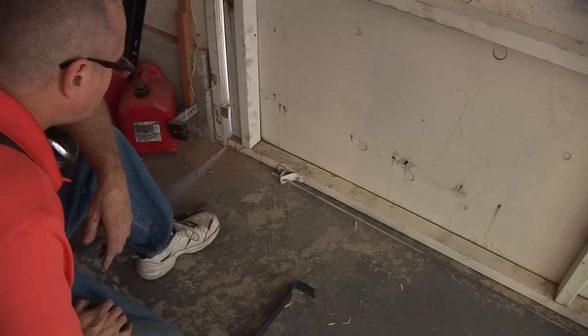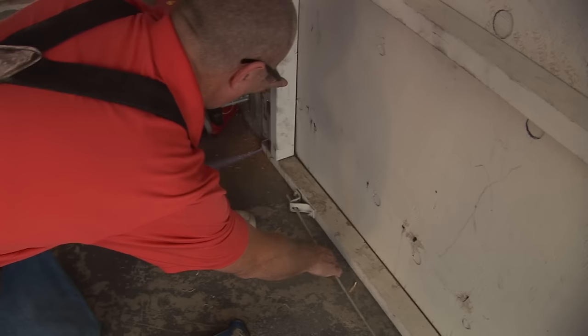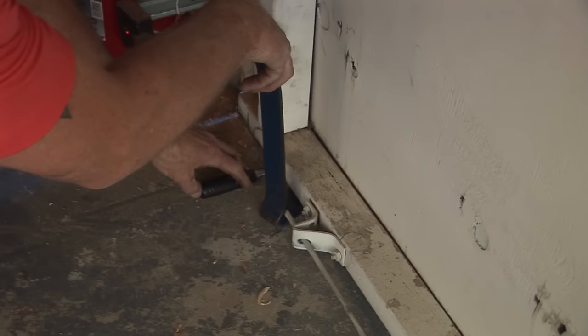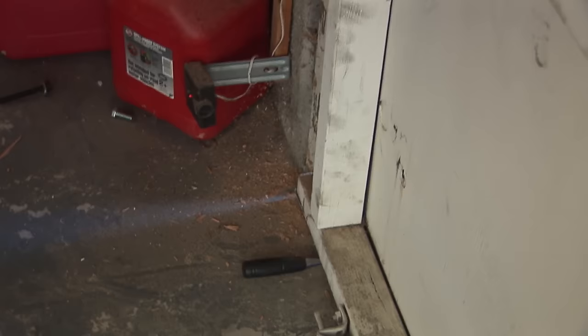Basically what we've got to do now is get the door off the ground. The hardware is not attached to the door and the door is resting on the ground. I'm going to pull the door until I butt up against my jamb bumpers, and then I'm going to lift the door off the ground. I'm going to stick one of my chisels in there — probably a good gap would be maybe a quarter inch or so — and we're going to do that on both sides.